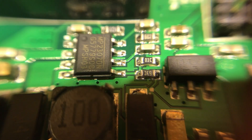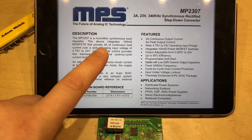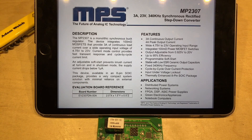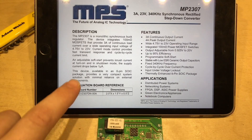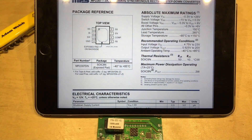In ultra-fine macro mode we can see that chip is an MP2307DN. Let's find a datasheet — here it is. It's an MPS monolithic synchronous buck regulator with an integral MOSFET, capable of providing 3 amps of current. It says wide input voltage of 4.7 to 23 volts — that's even worse than the Banggood listing. Scrolling down past the typical application circuit, we can see the absolute maximum rating goes up to 26 volts maximum.